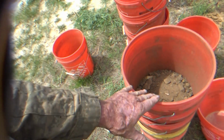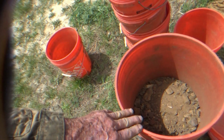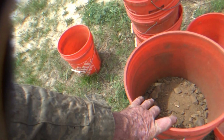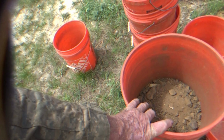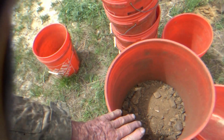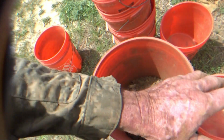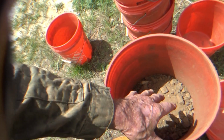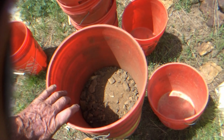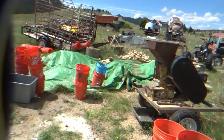And this is from the muck pile when I was just busting through, stuff was dropping, and by golly, I can't segregate or anything. So the question is, we got about 5 tons of stuff sitting on the floor of the 40-foot level. Is it worth processing or not? This I'm going to screen to 1/2 inch minus, and I'm going to have the 1/2 inch minus assayed, retain the 1/2 inch plus. If the 1/2 inch minus looks good and the other stuff is good, we can do the 1/2 inch plus later. So let me adjust the rolls, fire up the crusher, and get to work.